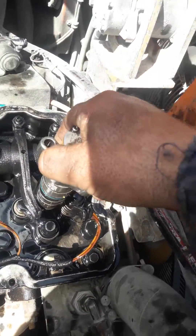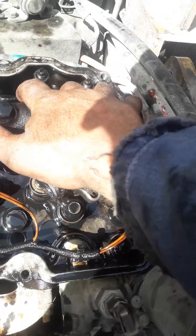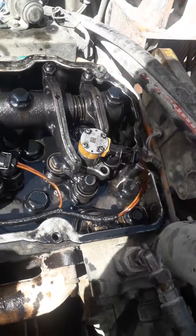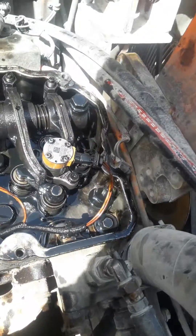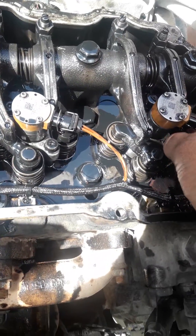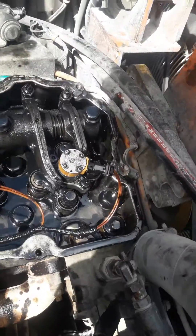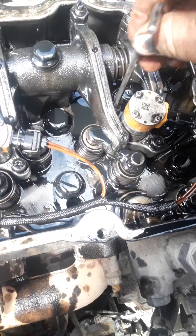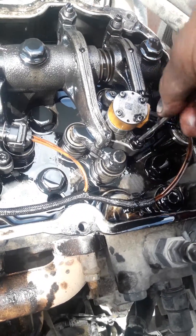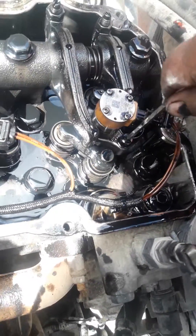Here we are putting the last one back in. Place it in the hole like that, hand on it, apply pressure and wriggle and it'll pop down. Bolt in one side, bolt in the other side. Just get one of them started like half a turn, half a thread, and then do the other one - otherwise the bolt won't reach. Once you get one going, go back to the other one, repeat the process and that'll just pull that injector right down to where it should be.